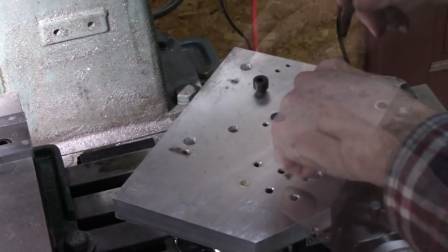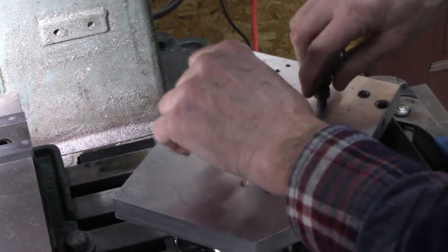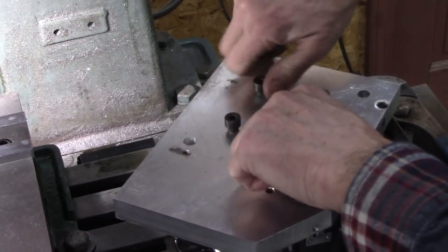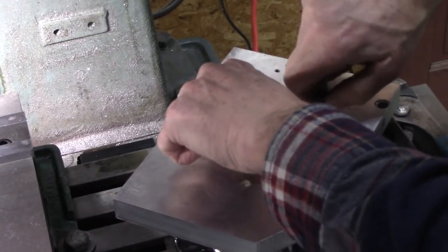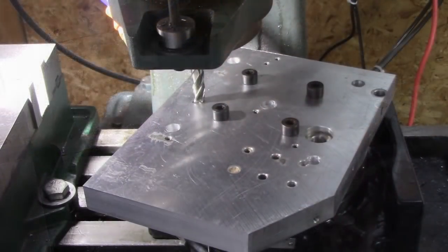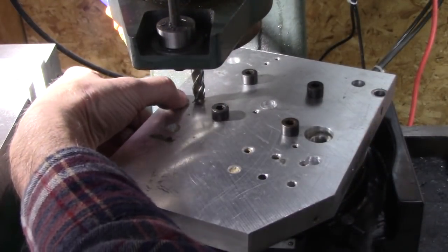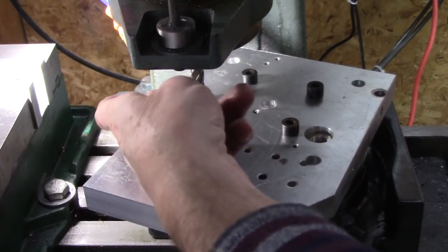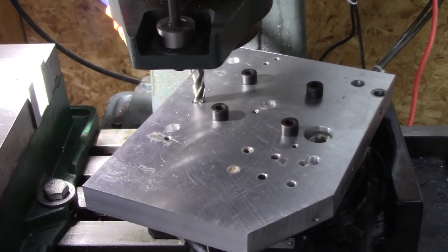Rocking just a little bit, and it's this aluminum, that taper will just create a very slight, it'll knock the edge off the edge of the hole and center it up perfect. Okay, I made a little mark right there, indicates the outer limit of my circle. I'm going to go in just a little bit from that, make one cut, and then measure it.